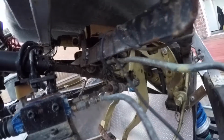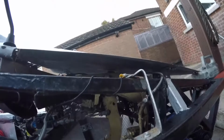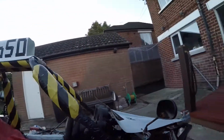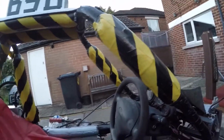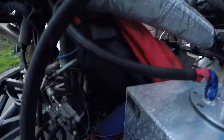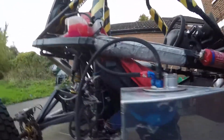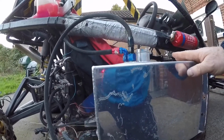The beauty of that steering column is that it's a collapsible one, but that wee buggy's very sturdy, you know, though the actual steering column will collapse. The airbag doesn't work, but with a 5-point harness in under that, I'll take it all. That's just a rally seat and that keeps it dry. The fuel tank is baffled with foam, which stops fuel slushing about. When you fill it up with fuel, it actually counterbalances the weight of the engine.